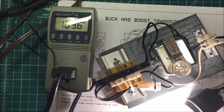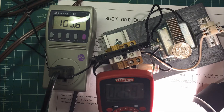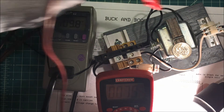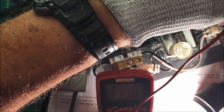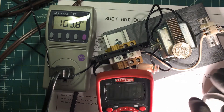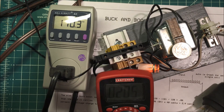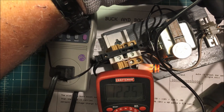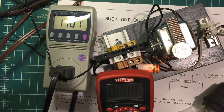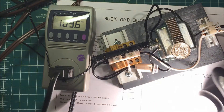Let me get a voltmeter in frame. I've got 110 volts coming in, and on the output I have 120 volts. Without a load I'm reading 122 volts, and with the bulb connected it lights up fine. The transformer doesn't even get warm.